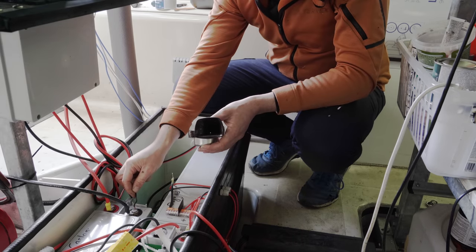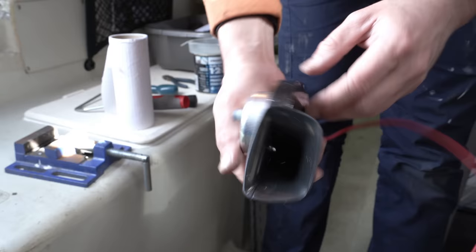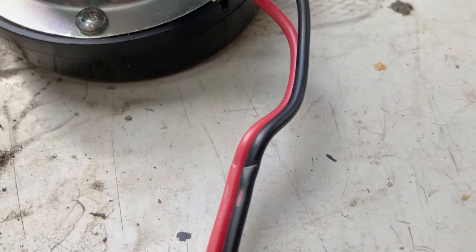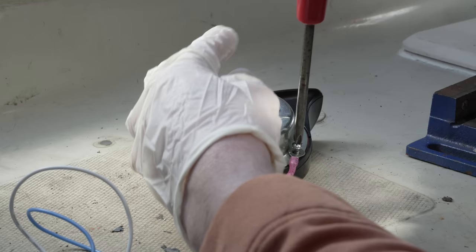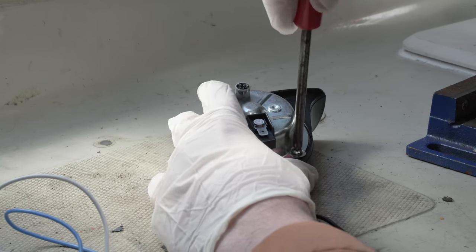It does make a noise, which is pleasing. But on having a look inside, I was less delighted. The tight fit within the horn housing pinched the power cables, and these should at least have been sleeved to avoid an unsolicited severing. I don't like the wires anyhow, so I'm swapping out the old ones for good quality silicon, and I'll double heat shrink the section where their discarded cousins were being pinched.